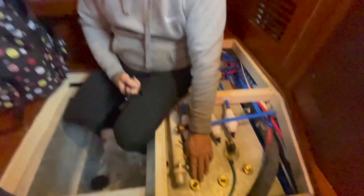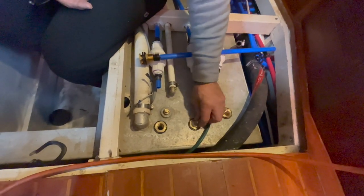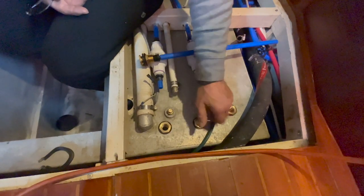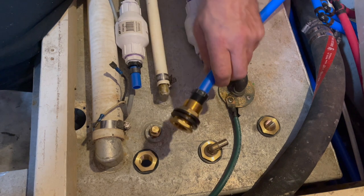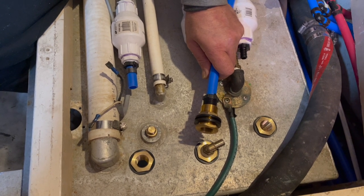I put the fittings into the tanks — there's three of them, one for each pump. The top has another PEX fitting, and you use white plumber's tape to seal it. You always want to have one extra. Everything on a boat that you're going to crew across the ocean — you need to have at least one extra thing. All these fittings and stuff, you need to have spares so you can fix the boat if something breaks.